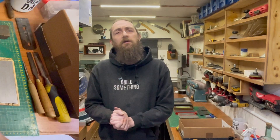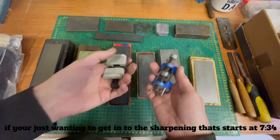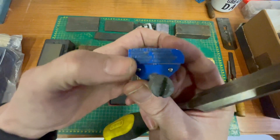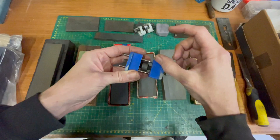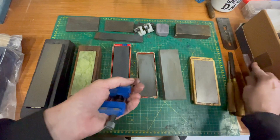These are some of the stones I've got, and this is a honing guide here - they're relatively cheap. You would put your chisel or your iron in there, and most of them have got a little guide that will tell you how far you want it to stick out to get the right angle. That stays around about 30 degrees or 25 degrees. When you start buying tools you're eventually going to need to sharpen them, and these are the perfect things to start with.